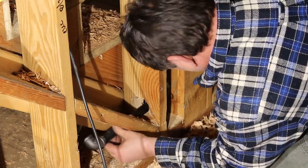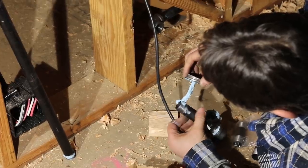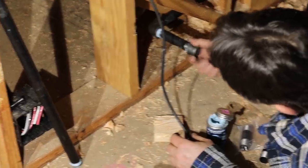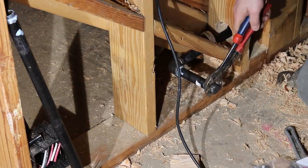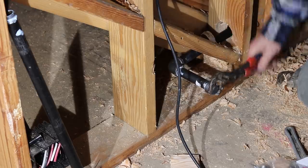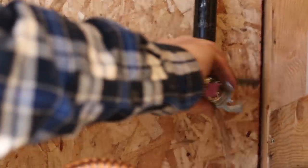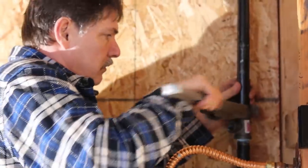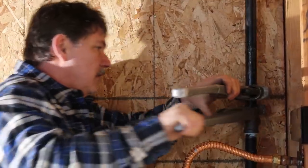The inspector will not pass this if it leaks. But Phil doesn't want it to leak either, so it's worth carefully testing each joint with soapy water. The system has to hold the pressure — no leaks allowed. If there are leaks, you basically have to tear the whole system apart to get back to the leaky fitting. Very time consuming. So if you're going to do this sort of thing, use lots of pipe dope, get a couple of big wrenches, and make everything nice and tight. Thanks for watching Essential Craftsman, and keep up the good work.